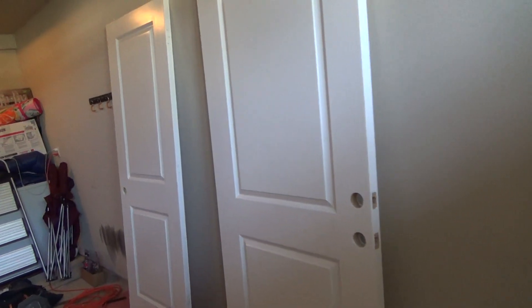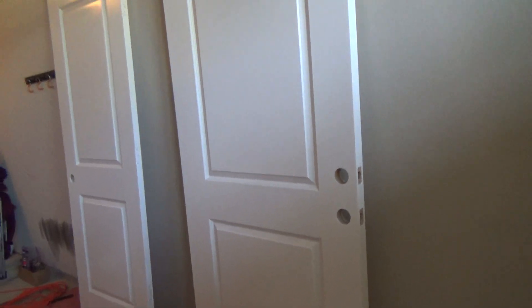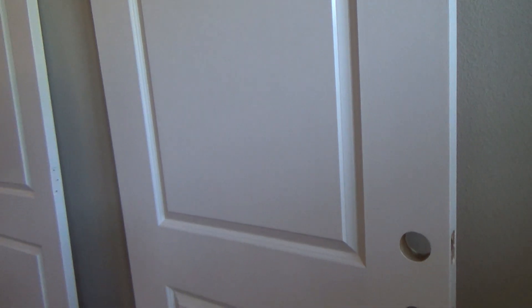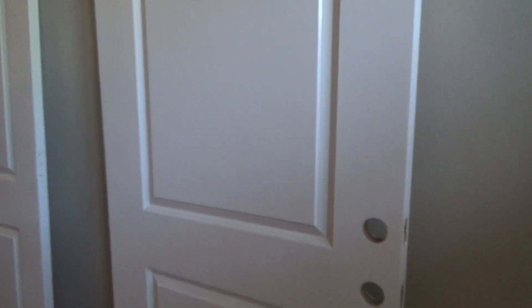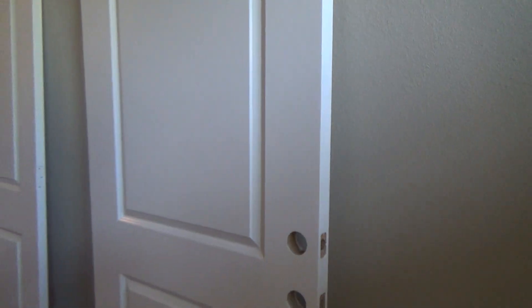If you're only doing one coat, let it dry overnight — especially with semi-gloss paint, to let it cure. For this door I'm putting two coats. I'll let it dry for probably half an hour to 45 minutes since it's almost 90 degrees and we're in a garage, so it'll be at least 90 in there. Even so, I'll let it dry an extra hour before I lightly sand with 150-grit sandpaper.